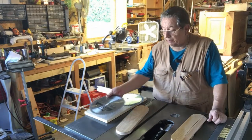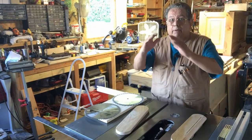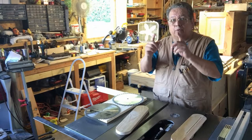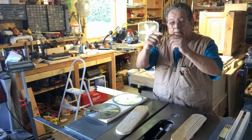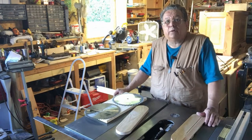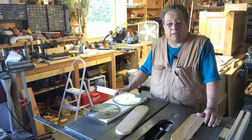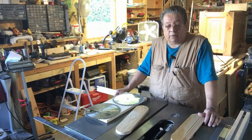They've got a different configuration altogether. They're not flat on top. They got a little bit of crown, but a point. Your two teeth go back and forth, and the center one kind of goes like this, and the top flat like that. But it's for a real fine, smooth cut, and mainly they came out with it for Formica. And I used to do a lot of Formica years ago.